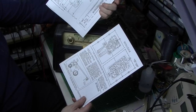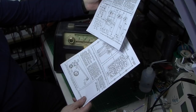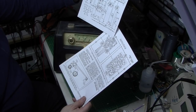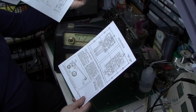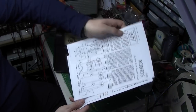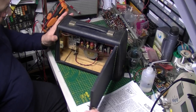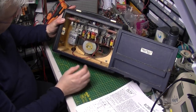I've printed it two-sided so it's a little bit back to front. But basically it looks like we've got three circuit boards in it, and we've got the dreaded AF117s in VT1, VT2, and VT3 by the looks of it. So let's have a look at those. It's 9V and it uses a PP10 again, so I'm going to need to look the PP10 up — I may have to design one of those and get it printed out.